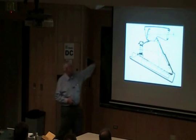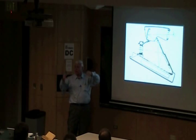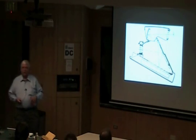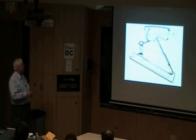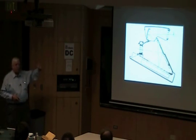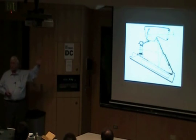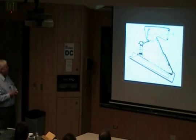Well, there's a way to fix that. If you imagine that as being part of the peel of an orange and flattening it back a bit at the top, you can raise those corners. That's what we did. It's an aspheric, an asphere of revolution. Kind of like an ellipse, but not quite. Its axis is actually slightly outside of the part down here, about like that. And it's a molded part, coated. And like I say, it's not a terribly interesting asphere because it has symmetry. And it makes a nice image in between.